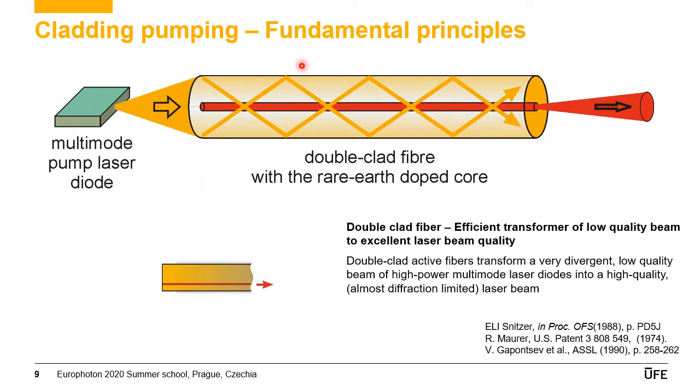This picture is also a very basic scheme of a fiber laser in a Fabry-Perot configuration that you can build easily in the laboratory. The perpendicularly cleaved fiber ends work as 4% mirrors. There is one simplification. The pump laser diode is usually not coupled directly to the active fiber. Firstly, it is coupled into a passive fiber that forms the pigtail of the laser diode. The fiber has a lensed fiber end for better coupling efficiency. So in the laboratory, you would probably focus the pump with a lens like it is shown in this picture.